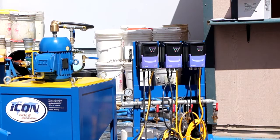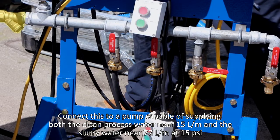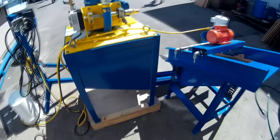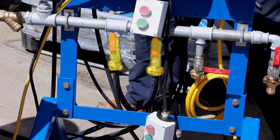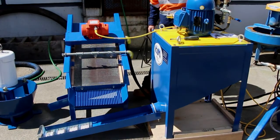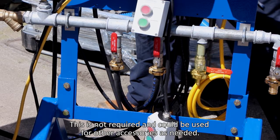The control station includes the water distribution manifold. The large barb on the left hand side is the clean water connection. Using the large diameter hose supplied, connect the large valve from the manifold to the brass barb on the concentrator. Using the small diameter hose supplied, connect two valves to the matched sized barbs on the screen. Open the valves sufficiently for the spray to fan across the full width of the screen. There is an additional valve included on the distribution manifold.